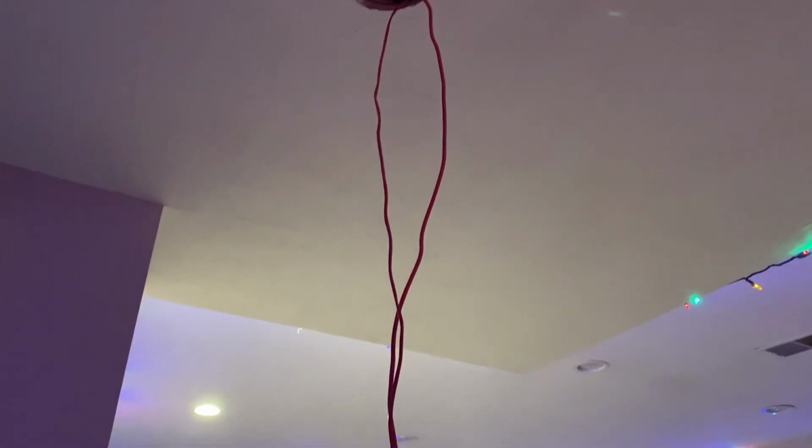All right, wire has been successfully pulled. Now I'm going to use that tent pole and fish it from that light up here. So I went ahead and fed the tent pole all the way over here. If you look in the ceiling, you can see that I have taped it to the pole. Also, I'd like to mention that at this point from this hole, I'm now running 18.2 for the smoke detector or pull station or whatever is going to be here, not 18.4, because I really only need 2 conductors for my zone. All right, so this is good.